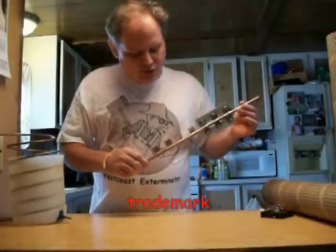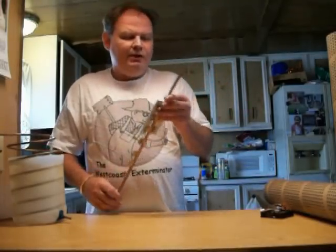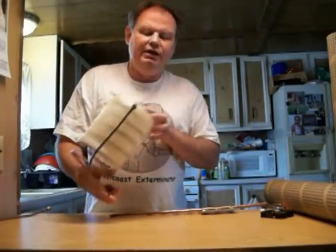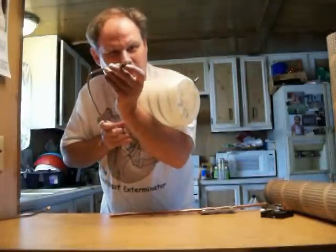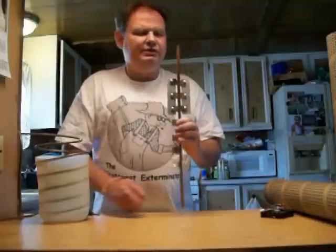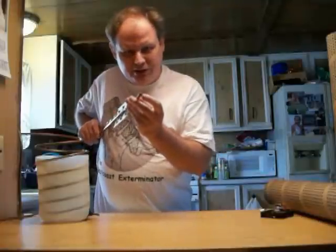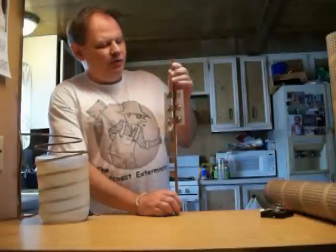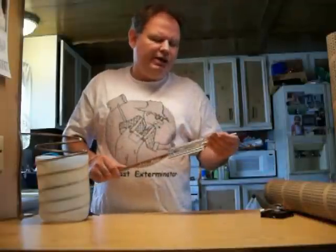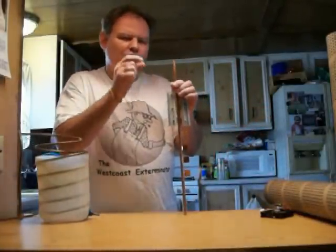You go thinner and attach cooling fins. This is just something I made for demonstration — I'm not going to put it on my still but it will work. This tube is a little bigger than my coil. The reason I wouldn't use it for reflux is it's just too thin — it's wide enough for a drop of water or alcohol to pass through but nothing else. That means water doesn't have enough room to drip down while the steam is going up. This next one is just big enough to allow a drop of water to run down while the steam is going up. I would go just a little bigger than this — at least a half inch pipe. You don't need two inch, three inch, or four inch diameter. Just a half inch diameter will work and you don't need it tall.